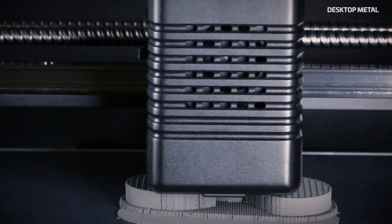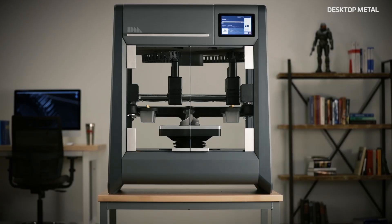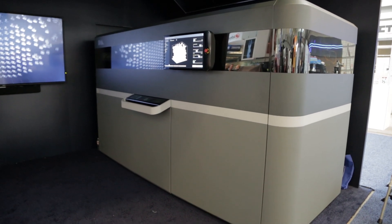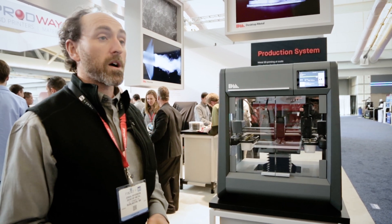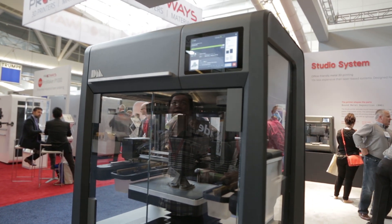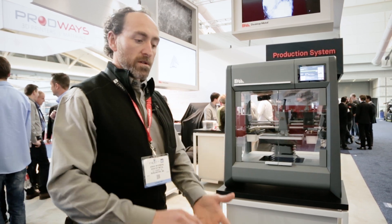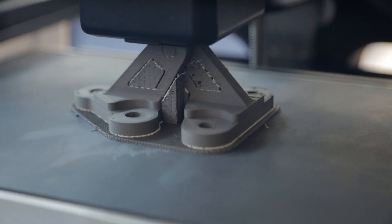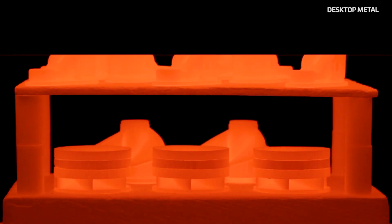What you're seeing here — the studio system — is not scalable to mass production. We're talking about 1 to 100 parts, so low volume. The Desktop Metal production system is 100 times faster and is designed to compete with high-volume manufacturing processes commonly used in consumer electronics or the automotive industry. It's designed to be a mass production build box — printing hundreds of parts nested on top of one another, not hundreds of print beds, but layers. Multiple layers with multiple parts on each layer, separated on top of each other. When you take the parts out of the printer, you put them into the furnace in the same way, on layers of kiln furniture, and then the parts are consolidated.